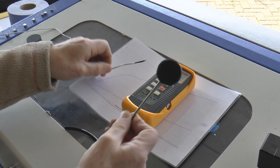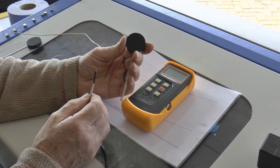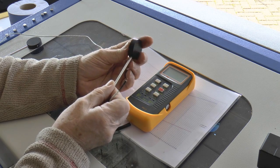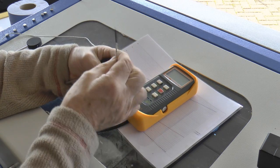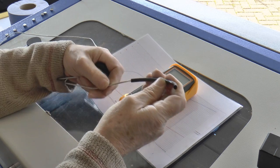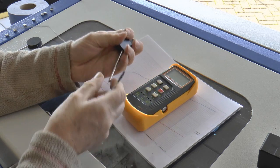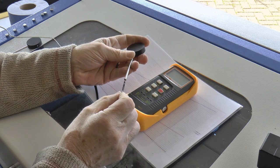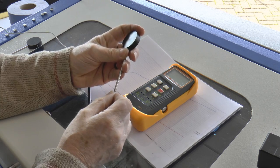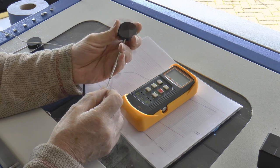So the first thing that we're going to do, we turn this lump of metal, which is a black anodized aluminium block, with a piece of stainless steel tube as a handle. Now, what I'm going to do is just thread a piece of 5x1 polyurethane tube over it to start with, just as a strain relief, as you'll see in the end.